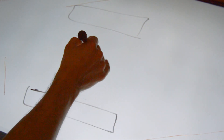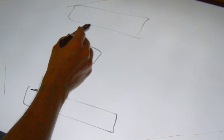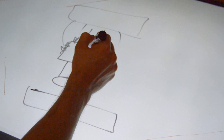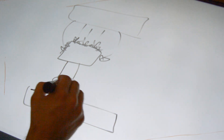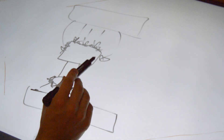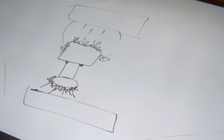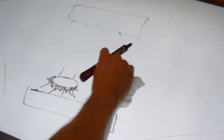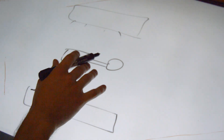Talking about part orientation: if you have an irregularly shaped part and orient it poorly in the bath, the electric field lines will curve around some edges while the surface closest to the electrode gets much stronger field lines and therefore much heavier plating. Areas that are distant and have sharp inside corners may get no plating at all. It's better to orient the part so you keep as many surfaces as possible equidistant from the electrodes.